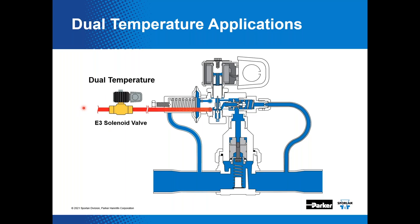An auxiliary solenoid valve could be installed in the discharge gas pilot line to enable a dual temperature application. When the pilot line is closed, the SORIT goes wide open and the case operates at common header suction pressure — a lower temperature. A small A3 or E3 solenoid valve could be installed in that high-pressure vapor pilot line to accommodate this function. When selecting solenoid valves, size matters: solenoid valves are designed to operate in conjunction with specific conditions, not simply line size.